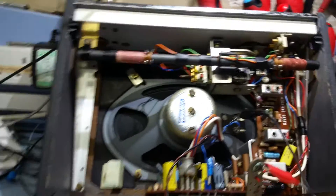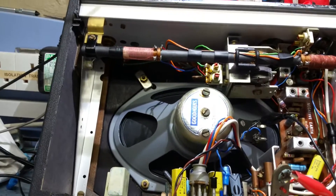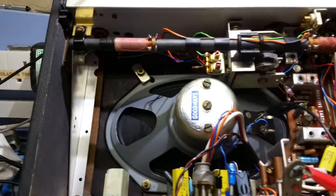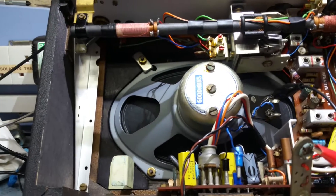As an RF detection tool, it's going to work fine for fault-finding radios. There is a bit of a thump when I connect it up, so I think I'm going to have to put that decoupling capacitor down to about 1 nanofarad or something like that, because it's quite a thump when I switch it on. And what I'm worried about is if I go across a higher voltage line, I might blow the amplifier up, which I don't really want to do.